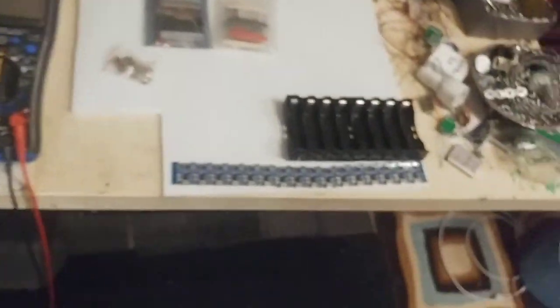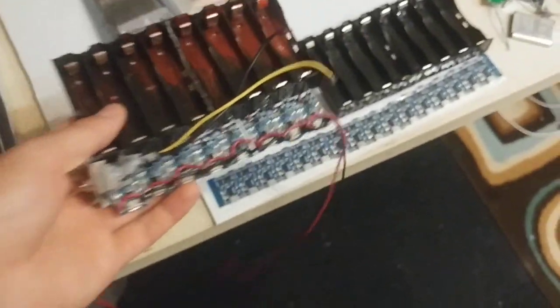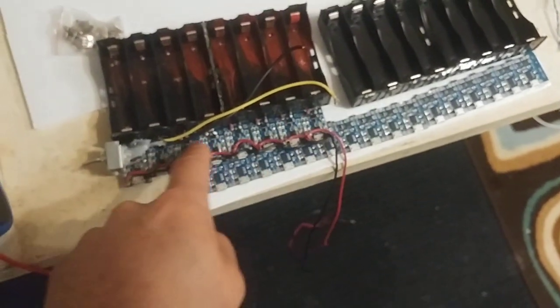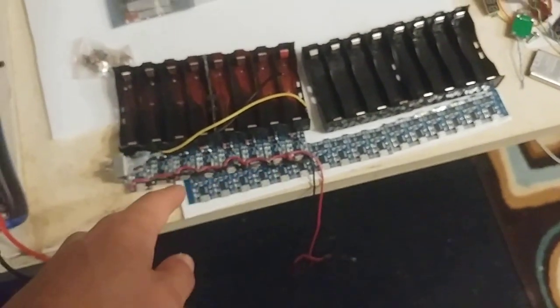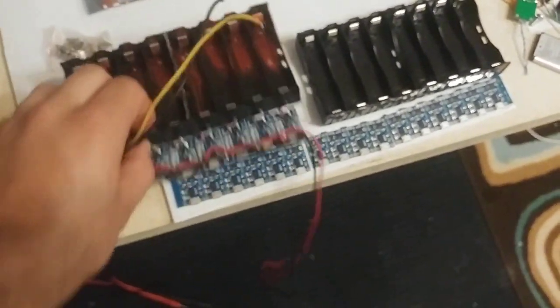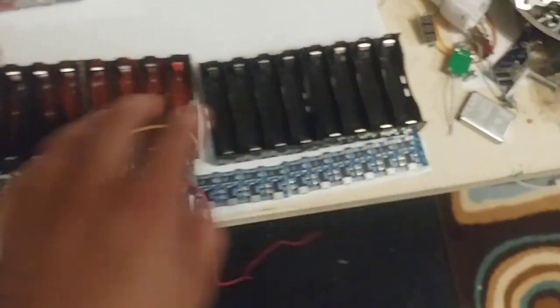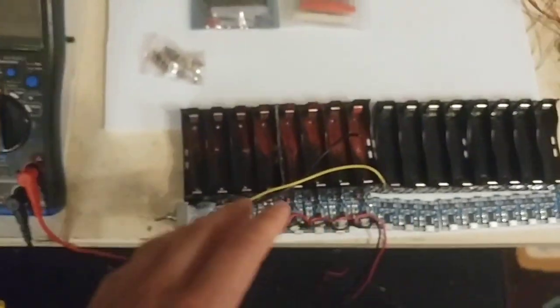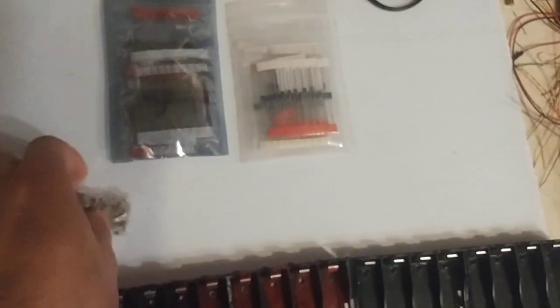I bought two more LII's since they were on sale. I'm also redesigning this charging station since all of these TP4056s are blown up by accident. So I'm going to have to install diodes in the future just for safety — there was a wiring issue, but not a big deal. The next one will be basically this but much bigger, so that'll be nice for just charging up batteries. It'll save me a lot of time. Here are the diodes I have set out for that.